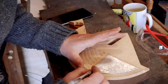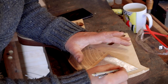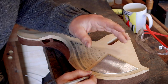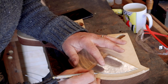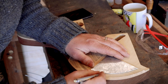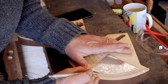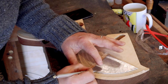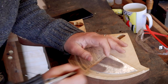Okay, decisions. I am going to have that as a bevel, as a chamfer, all the way around, recess the whole thing below the level of the top. It's going to be an interesting carve, but I want to hold it in with large-headed screws or bolts or something like that. And essentially, I want to have a notch cut out of those chamfers, and then the bolt will hold down over the top of that, and we'll have them placed around.